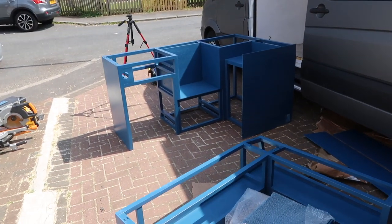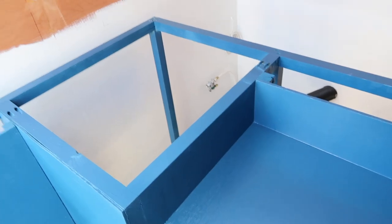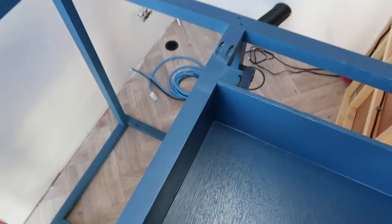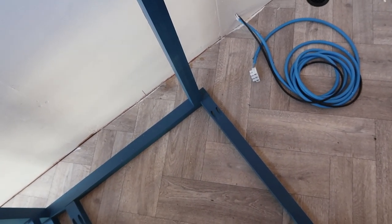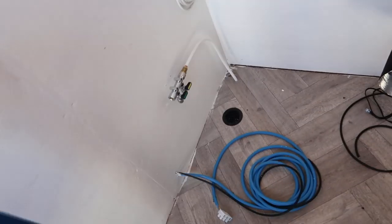Kitchen's just come back from Spray Tech Joinery - let's get this bad boy in. Fitting the kitchen carcass now - the gas feed is already in, there are wires and piping out of the back, and it's pretty much made to measure so it'll push in quite snug to the wall. When I made it with that in mind I put some screws in the corners I can get to so I can split these joins to get the wires around the back and access the pocket hole screws for the gas feed, then it'll slide into place.